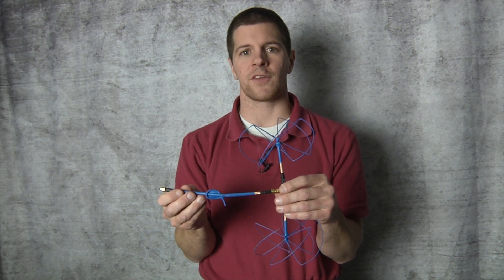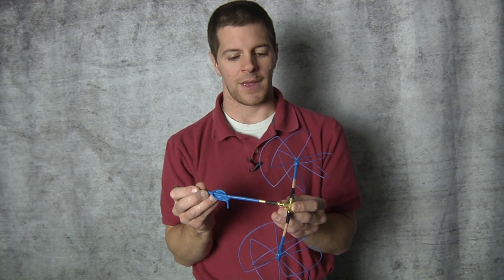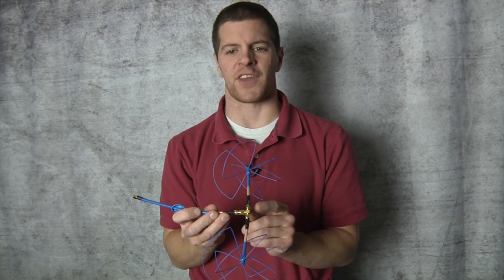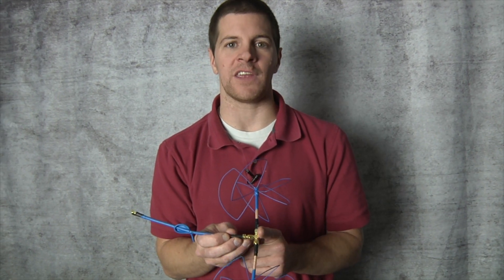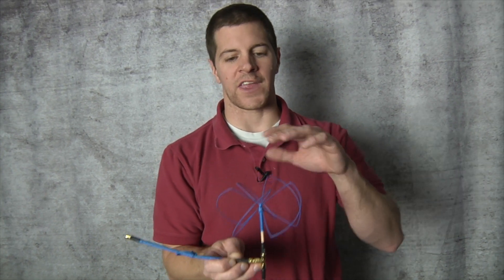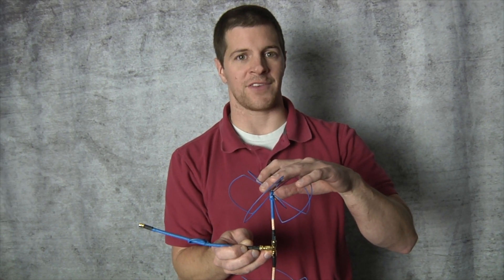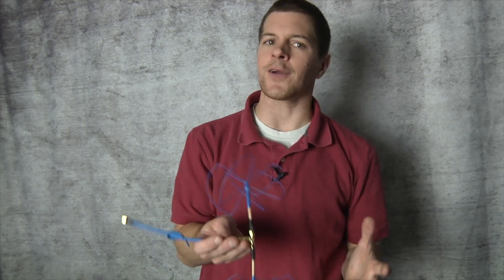At first glance this appears to be just two mad mushrooms stacked on top of each other to a T-junction. Now you might notice that a few people have been selling this T-junction as cheap diversity, which is a blatant lie. The truth is you can bring two antennas to a T-junction but you don't get diversity — you get changed performance. In this case the two antennas stacked on top of each other increases the gain from just 1.5 dBi to 4.5, so it reaches out further but it squashes the beam down. So it's not a good altitude antenna, but it's a great distance omnidirectional antenna.